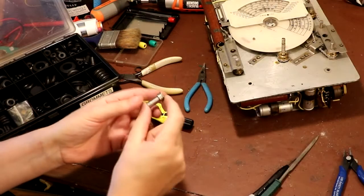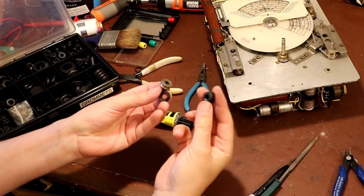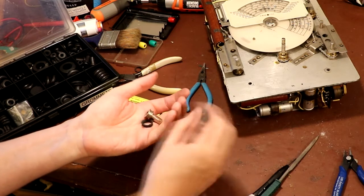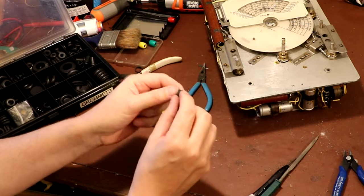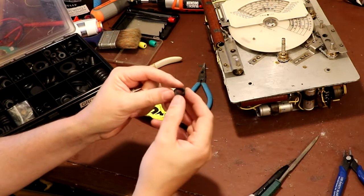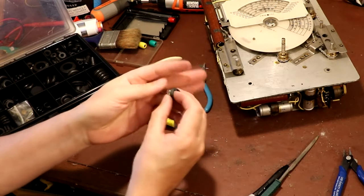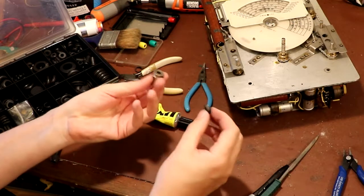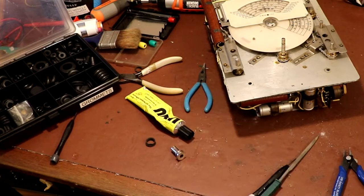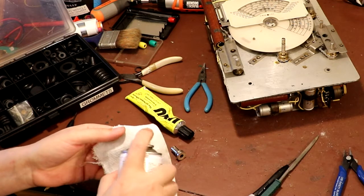So here's our little capstan with its missing rubber tyre. The nearest thing I could actually find is a grommet like this. What I've done is I've actually cut the outside edges off the grommet — quite crudely — and it's just left me with this little rubber tyre. It does appear to work — I have tried it. I'm not going to say it's a perfect solution, but I think for the moment it's probably about the best I can do. So I'm going to go ahead and just try and glue this onto here, and hopefully it will last long enough for us to get this piece of equipment up and running until we think of a more permanent solution.